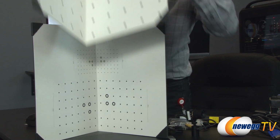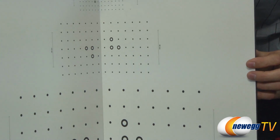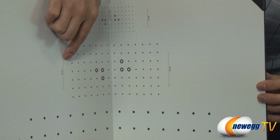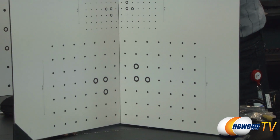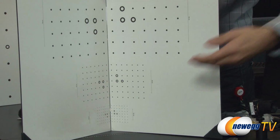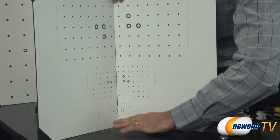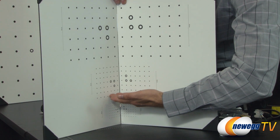That's very important for the scanner to actually work properly. I'm going to lift this up and show you the other calibration panel that we have here. At the top, 30 millimeters, 60 millimeters, and 120 at the bottom. And all you do basically is just flip this upside down depending on which size object you're going to use, or you could get just a very small object to place it on top of to keep it level right at the 60 millimeter area.